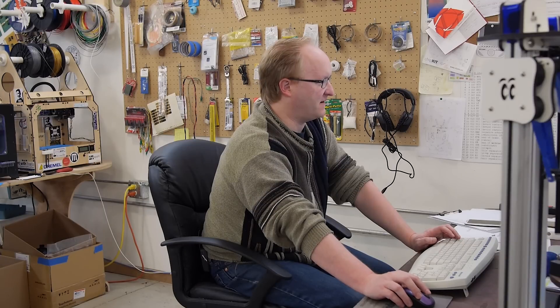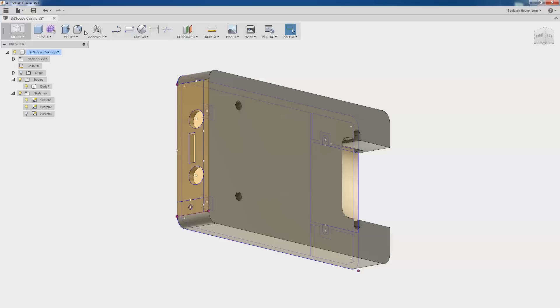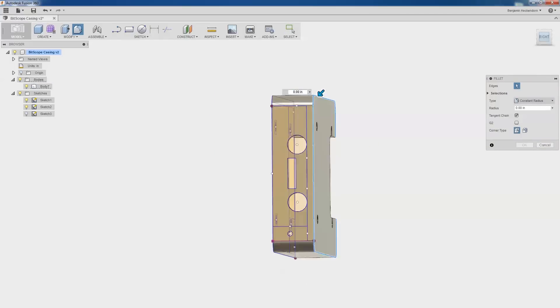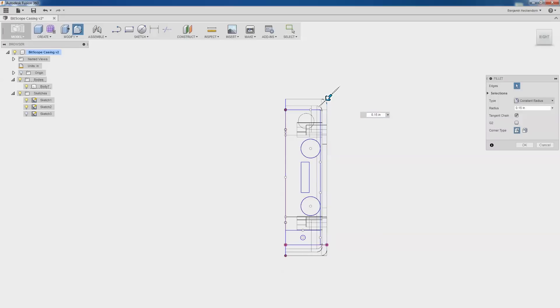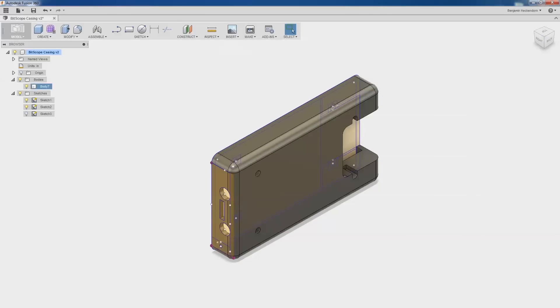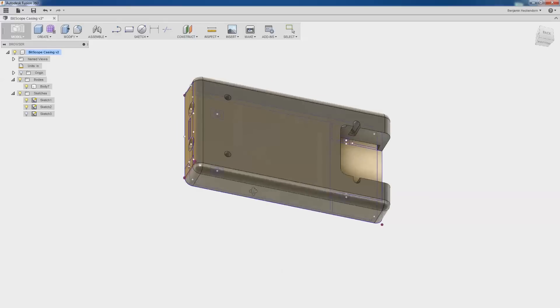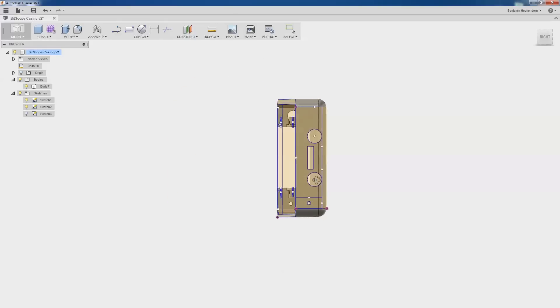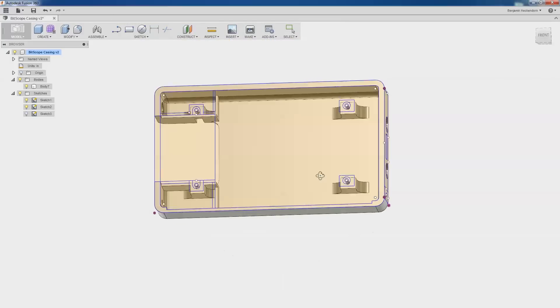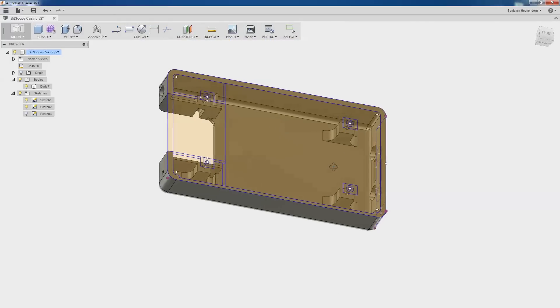Let's take a look at what we have. It looks pretty good. I'll give a curvature to the back just to make it look nice and also make it a little easier to remove from the build platform. I'll add a fillet and switch it into wireframe mode to make sure I don't fill it past the inner groove. 0.3 looks pretty good. Let's take one more look rendered — there we go. USB access there, power jack, probes, and the screw holes down here are for the pivot mount. I'll design the pivot mount once I have this thing running on the printer.